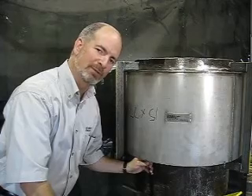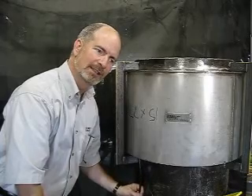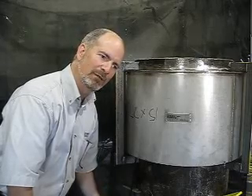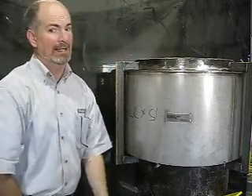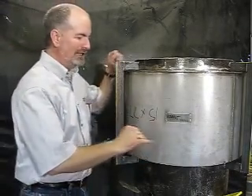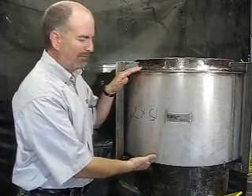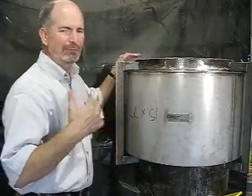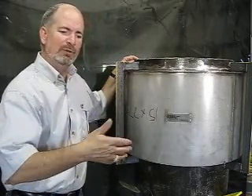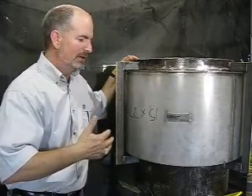You want to make sure you get the boroscope all the way to the end, then turn it and start bringing it back down — bumping it up and down against the convolutions for a count. Starting with the first one: one, two, three, four, five, six, seven, eight, nine, ten, eleven, twelve, thirteen, fourteen. And that's what the drawing shows — fourteen convolutions. We just did a convolution count. We generally know how far apart the convolutions are and we get an outside dimension. We can reverse engineer that — we know the pressure, the temperature, and even if we don't know the movements, we can back into them based on what that bellows configuration would take.